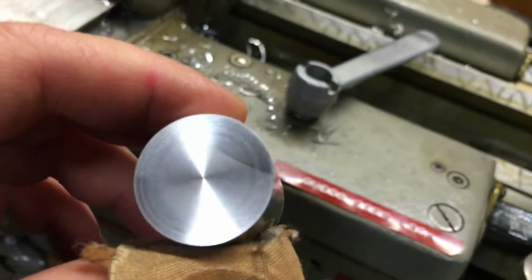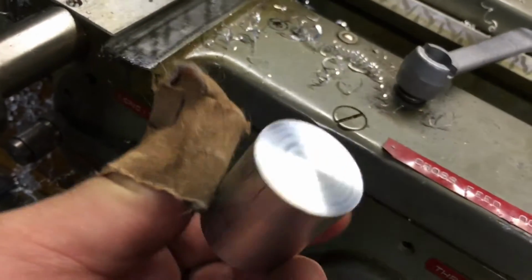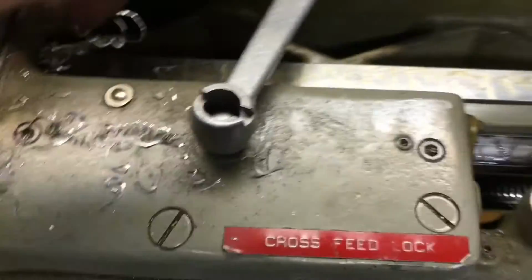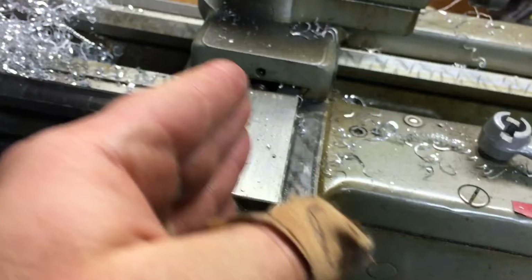As usual, I'm like, you know, a novice apprentice machinist. No one's teaching me how to do this stuff. And if you can see the cut on this side, it's kind of wavy. It's not really flat. Well, all of a sudden I realized that this thing kind of moves when you're doing a cross cut. This thing can still move backwards.